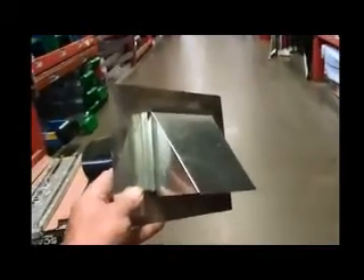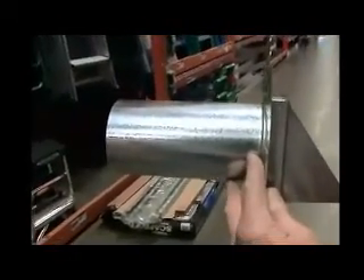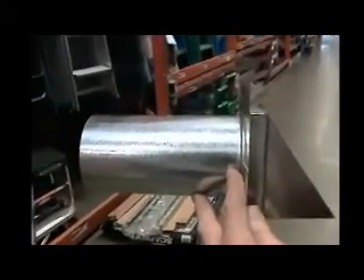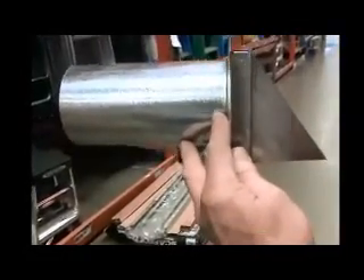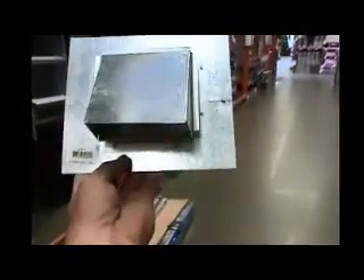As you can see, that screening is quarter inch — that's too big. The dryer vent looks fairly well sealed. This is a typical kind of dryer vent that you see. They hook the pipe from the dryer or the bathroom exhaust that goes through between the first and second story. Typically what happens is they mount this and they stucco it, but there's a gap between this face that bees can get around this piece into the roof cavity or into the cavity between the floors.